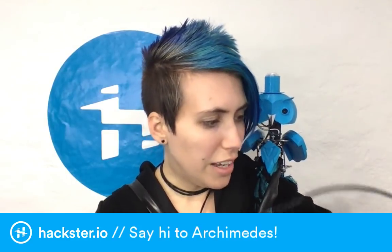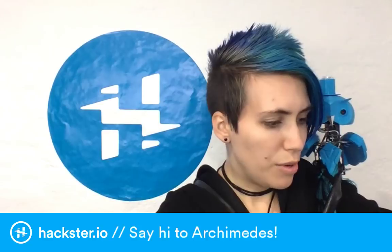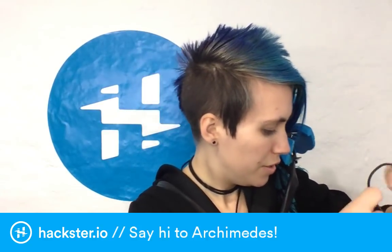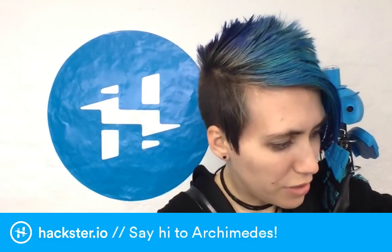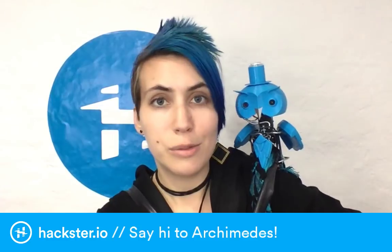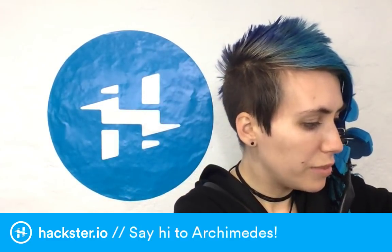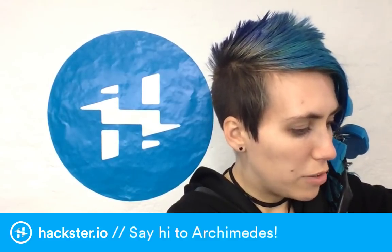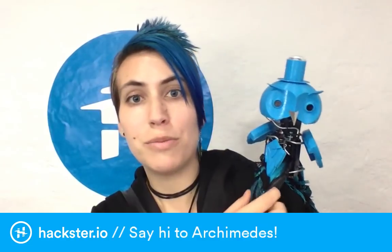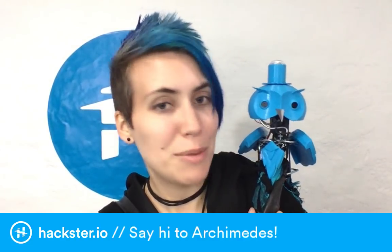And the AIY stuff is going to take a minute to boot up. The rest of the stuff should be pretty quick. Let's plug in the Pi first. The Arduino stuff is almost instantaneous. So another issue that I ran into was that the servos would just sort of turn off, the battery that I was using, this is pretty common for USB power banks actually, would just turn off after a brief spate of movement. Not a super long cable there.